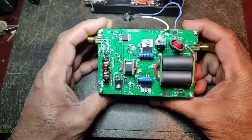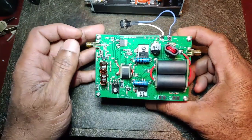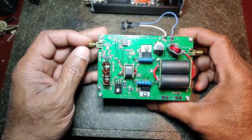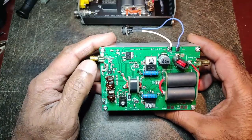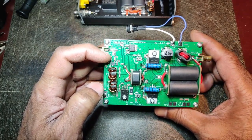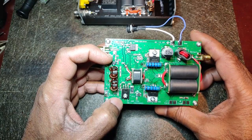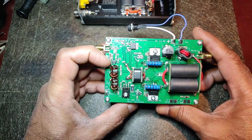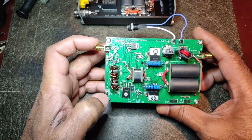For the money I think this is a well-made board, although the gain is a compromise. They say it takes just a few milliwatts input; I tested it with a minus 20 dBm signal across all HF bands and got a good output. At the input they have provided a 3 dB pad — not exactly 3 dB but very close. It's a pi-network where R1 and R2 (the pi legs) are 300 ohms and the in-between resistor is 20 ohms, equating to approximately 3 dB. From there it goes to the pre-driver, so your rig will see a 50-ohm load, which should be safe.